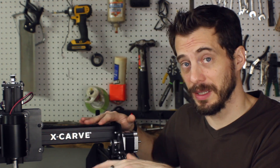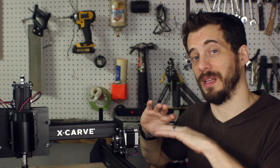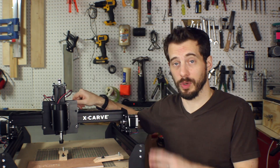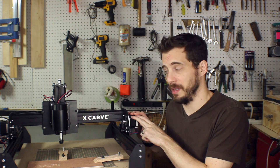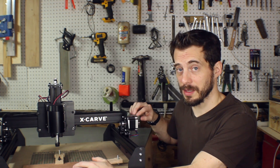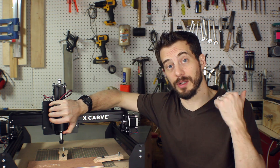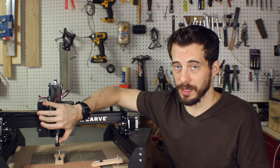Even though I was filming this one, it went together a lot quicker than my Shapeoko II simply because there are fewer parts. They cut down the number of parts by like 50%, so whereas before the X carriage was two plates with a bunch of spacers and all the stuff you had to put together, now it's one big piece, which makes it faster to put together and just more rigid. Also on this machine, I got the larger motors instead of the smaller ones that I had on the Shapeoko, and you can tell the difference — the machine's a lot more powerful. My recommendation is if you're going to be doing any serious work with the machine, go ahead and get the larger motors from the get-go. The only problems I've had with the machine so far are really tiny. One, the spindle is a lot louder, even though it's just as powerful, as the quiet spindle that I have on my Shapeoko. I really enjoy the quietness of that one, so it'd be nice to have a quiet one here, but I can upgrade that at some point.